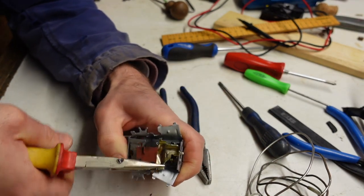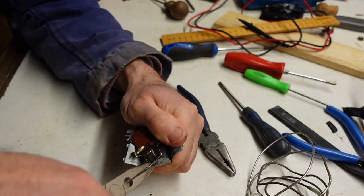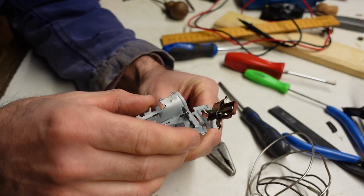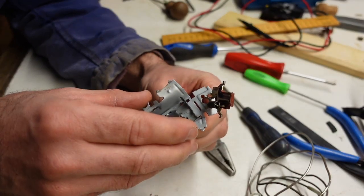I'm sure the adjustment is done in the factory because I don't know that I would touch it. There's a pretty substantial spring there pulling against it that I've just released, and there's another spring pulling against something else — this fellow here, I presume. So that's one adjustment and that's the other adjustment, and then it's not a potentiometer — it's a mechanical switch that adjusts it. That's interesting; it looks like a pot from the outside.